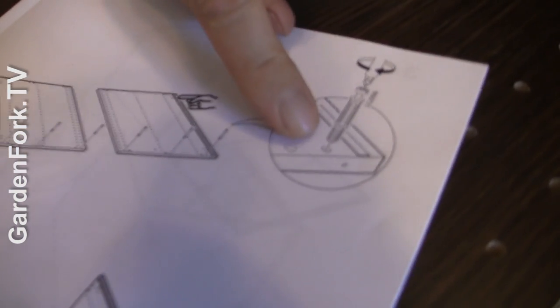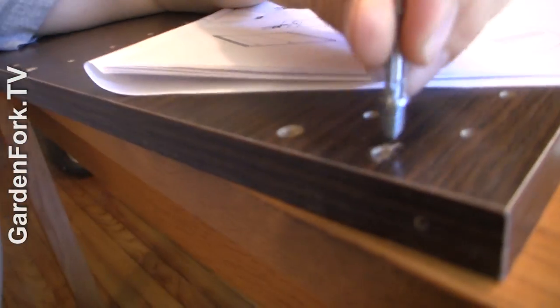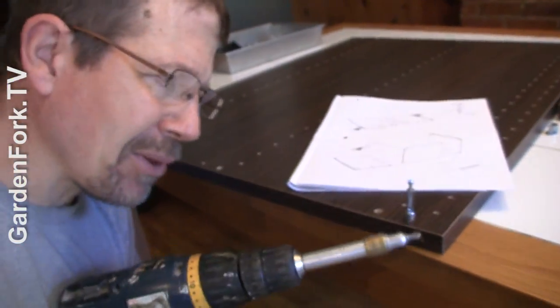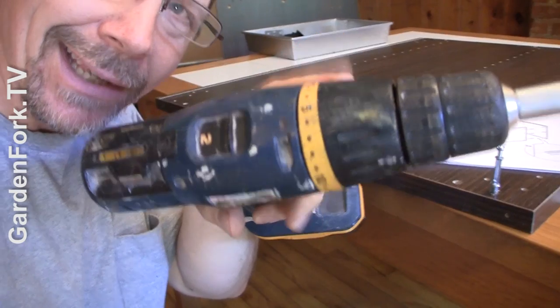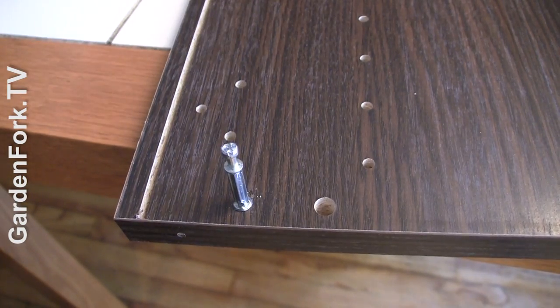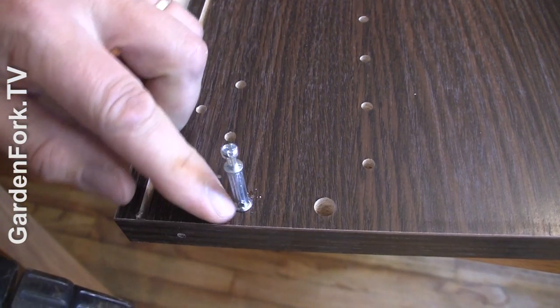On the instructions, they have a close-up of which hole this first screw goes into — pay attention, it's all in the details. This screw drops in here and I always put them in by hand first, then use my screw gun. It's really easy to blow out the wood if you overpower it, so set your torque setting — usually on top of the cordless drill — to a really low number, like five or seven. That keeps me from stripping the wood and puts the screw in at just the right tightness.